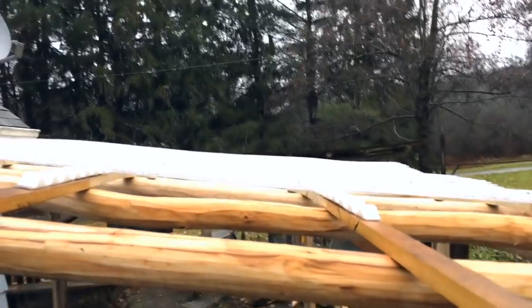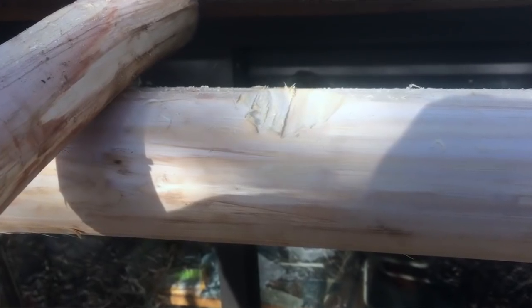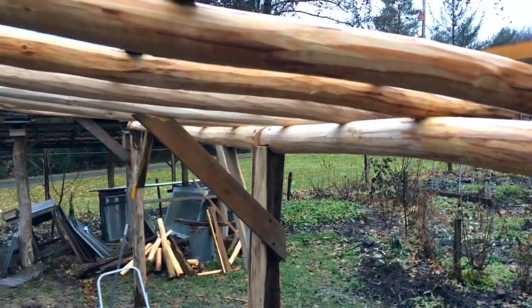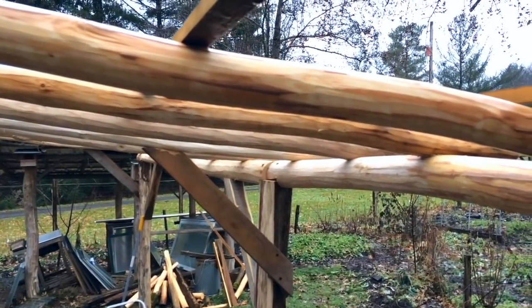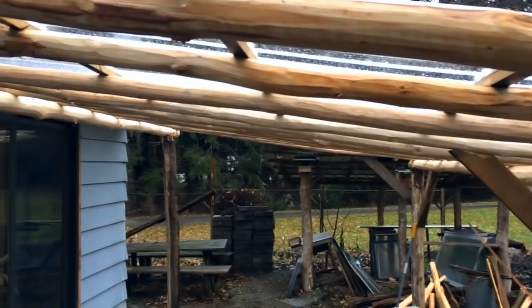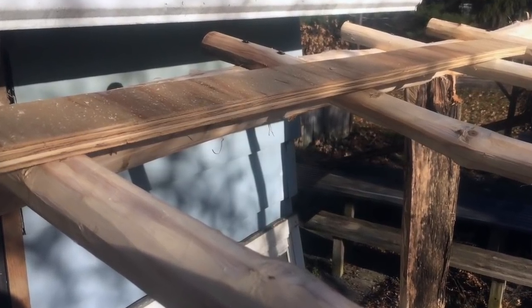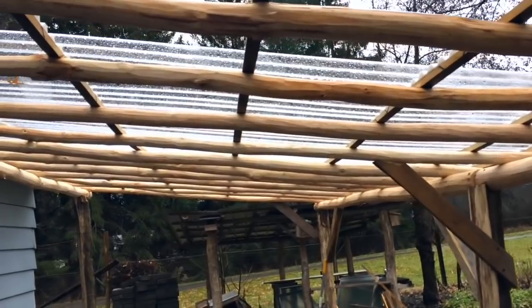So that's what I did with each of these — got them up and on, laid them out, and turned them until they were flat. Then I made a little bit of a recess on the receiving headers, just a tiny divot with the chainsaw to receive and cup it. Then pre-drilled and used the timber lock screws to really sink those rafter members down and on. By eyeballing it and using a piece of plywood as a reference, I was forming as close to a plane as possible. That seemed to work quite nicely.